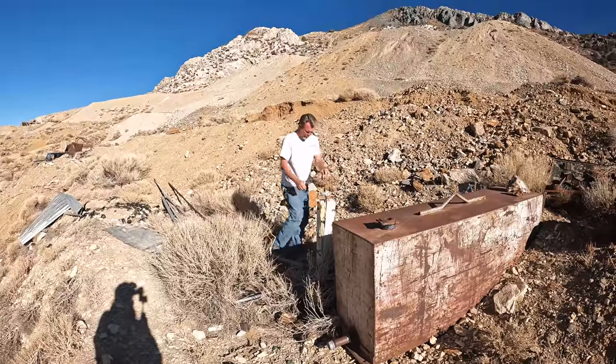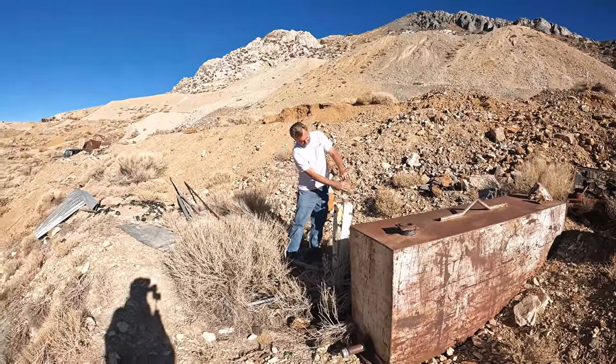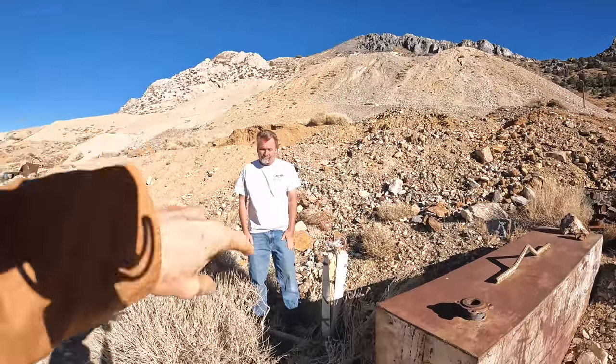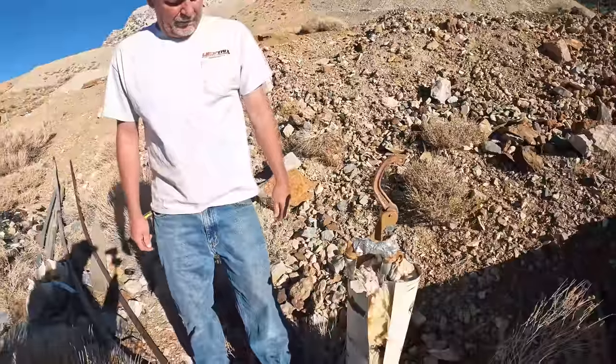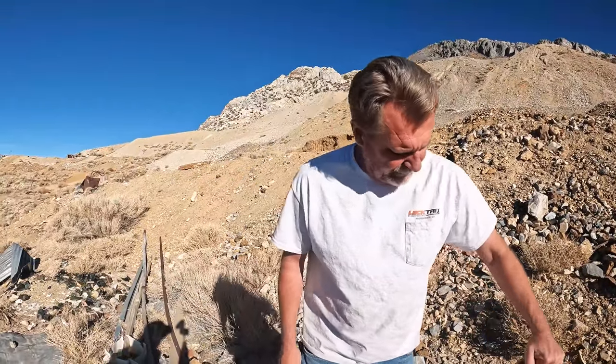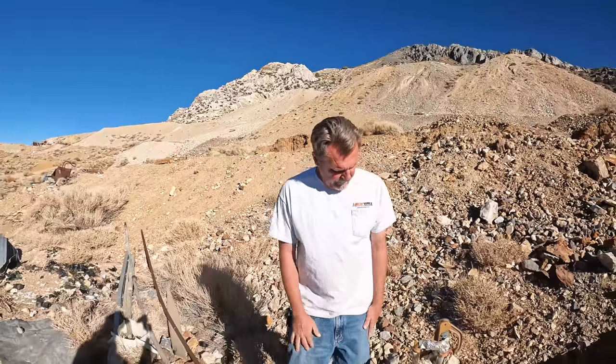Here's Craig, and what we're going to try to do is show you guys exactly what the water system is. The mine is way up here, but it comes out here. This is a winter frost-free hydrant, and so when we shut this off in the wintertime it actually shuts off below ground, so it will not freeze unless somebody forgets to shut off.